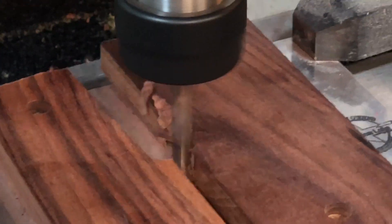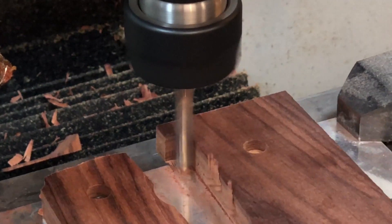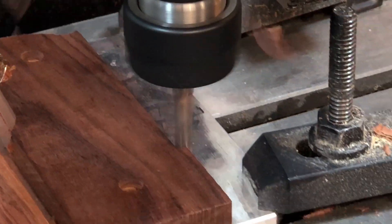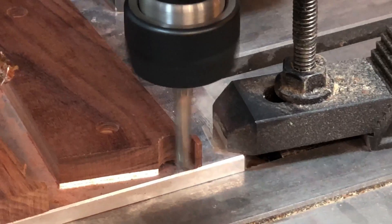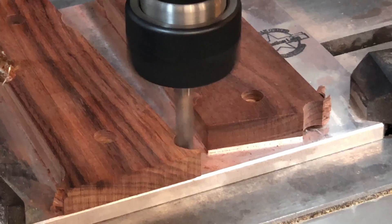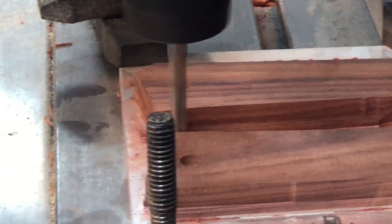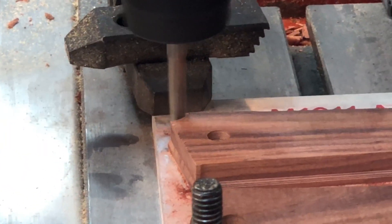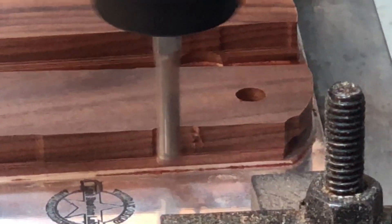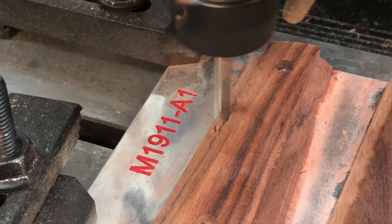We will clear away most of the material using a single-flute router bit from Harvey Tools — it's a great tool, it's not cheap, and not sponsored. I'm running an adaptive toolpath with a very shallow depth of cut. That's how I'm able to get those little tiny steps in the part, which means the ball cutter has less material to remove when we get to the parallel path or smoothing operation.